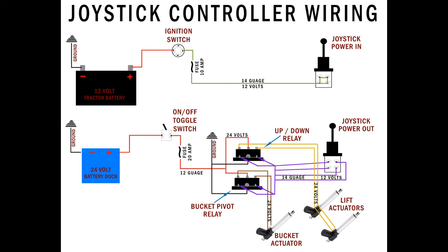Looking at the top portion, where we're using the tractor battery — it goes through the ignition switch, and of course it's fused, then goes out to the joystick and provides power. Take note that the joystick is wired all together on one side — one half of it is totally joined together, so that you have power ready on each position. You don't have to wire each and every terminal individually, but you have power ready to go to the opposite side of the joystick in whatever direction you want the bucket to work.